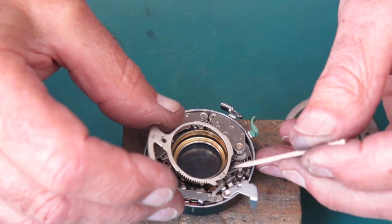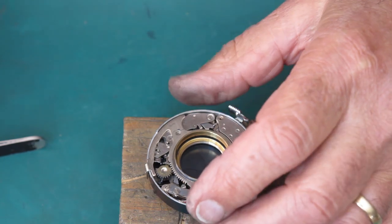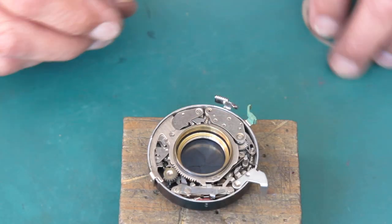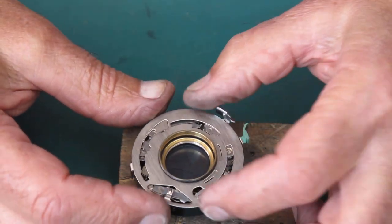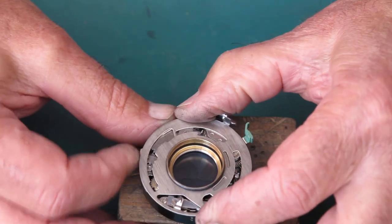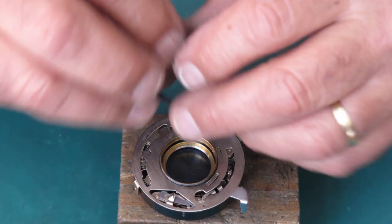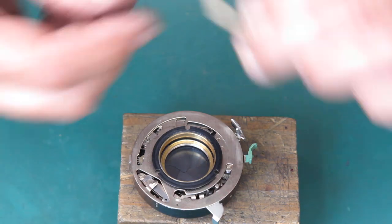Put this back in place. That pinion's keen to get out of adjustment — let's get that back where it should be. Cam plate in place. This should be an eighth of a second — what do we get? That sounds believable. About a fifteenth — yeah, I'd be willing to believe that's somewhere near. I'll put the front retaining ring on lightly and go away and check this on my speed tester and see if we're good to go.